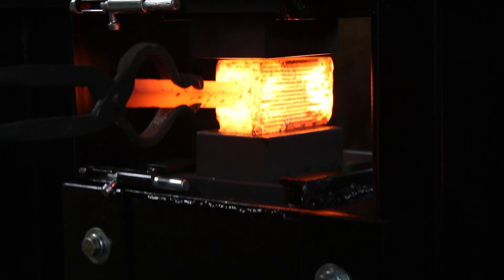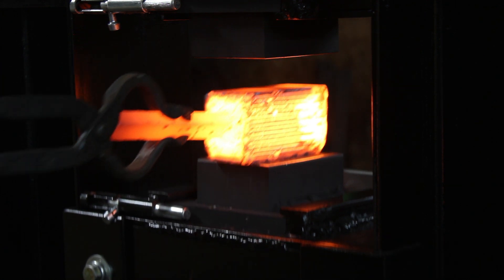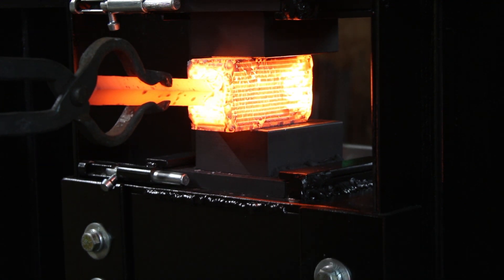Right here I'm running the press with the valve at the factory setting, which was only 1000 psi on my pressure gauge. But you really need to have a pressure gauge installed if you're going to make any adjustments, and I'll show you where to do that in just a second.